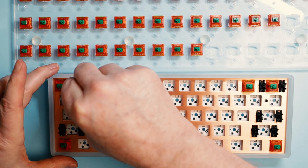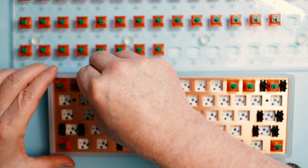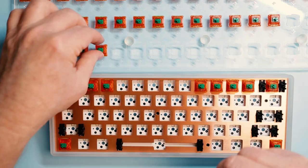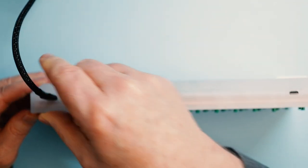You might want to check the function of each of the four switches. If all is correct, you can screw it down. I used an electric screwdriver in a lot of the work I do, but this step is better done by hand, as you don't want to over-tighten these. My rule is that if I am screwing into anything plastic or acrylic, I use manual screwdrivers. Once that's done, it's time to put the switches in. It has been suggested that the Karina benefits from starting with the outside switches first, alternating left and right sides, and working towards the center, as the plate has a bit of flex and this will avoid bent pins. This is probably more important on three-pin switches like Holy Pandas, but certainly doesn't hurt anything.